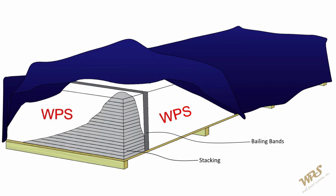All horizontal surfaces, including panels and pallets, should be covered with a clean membrane or board to protect the panels from damage. Panels need to be stored in an area that is well covered from the elements, cool, ventilated, and dry. These products must be kept covered on a pallet off of the ground.